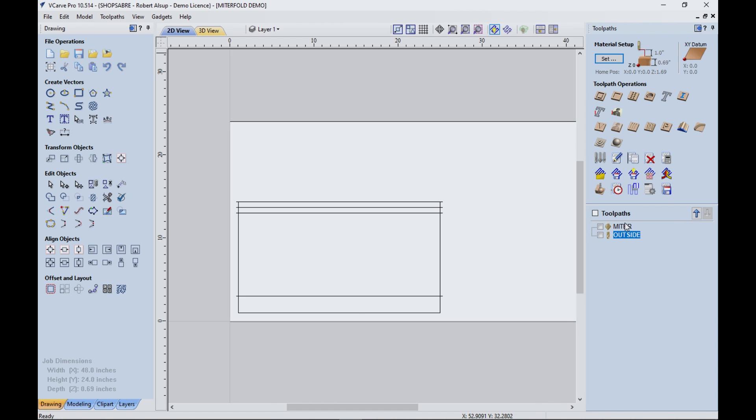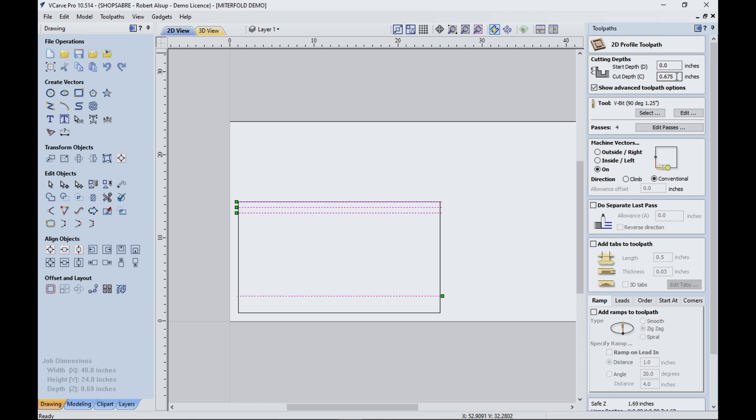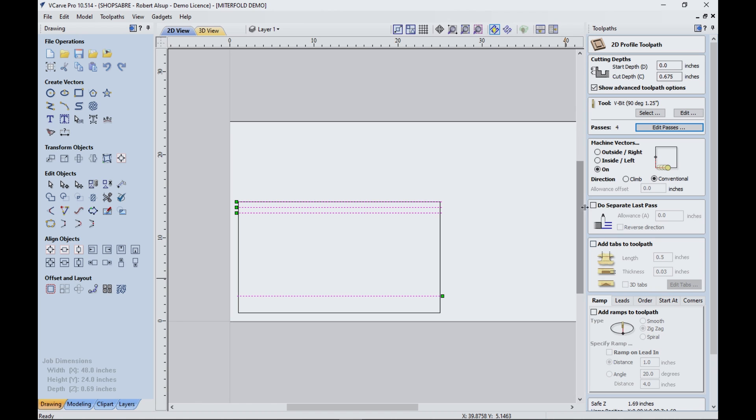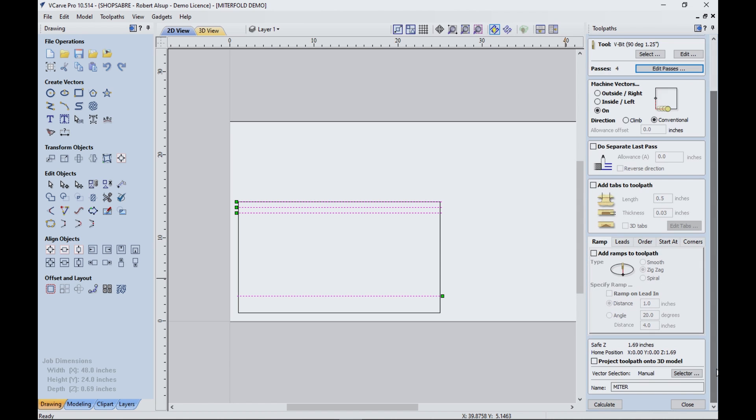Let's look at the miter first. The depth of cut is 0.675 — where does that come from? In VCarve Pro, Z is the variable for how thick the material is, so it's whatever you set up, minus how thick you want the hinge point — 0.015 — equals 0.675. VCarve Pro calculates that for you, which is a really handy thing. I'll also set multiple passes: four passes, so the cutter cuts its way in on the line. Let's hit calculate — and there are our paths.